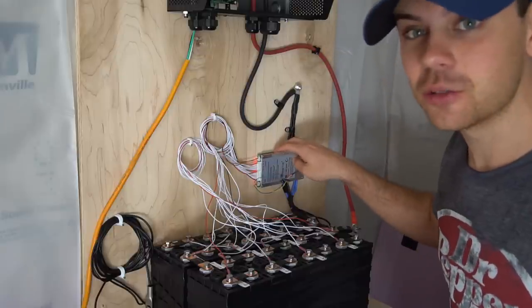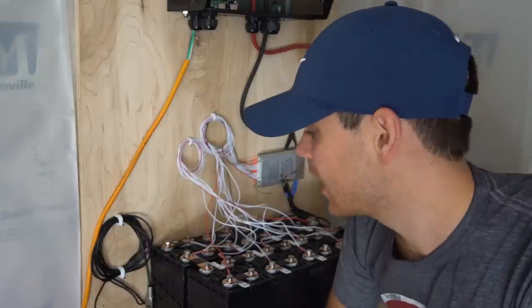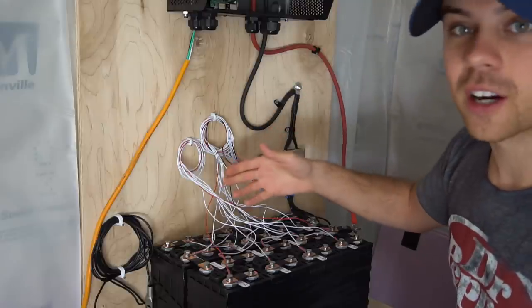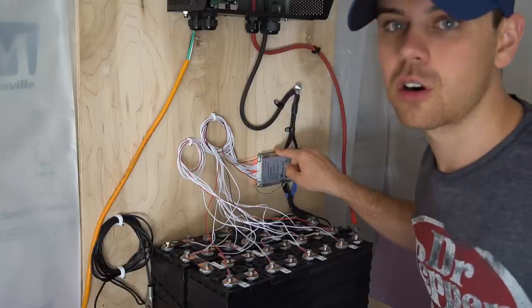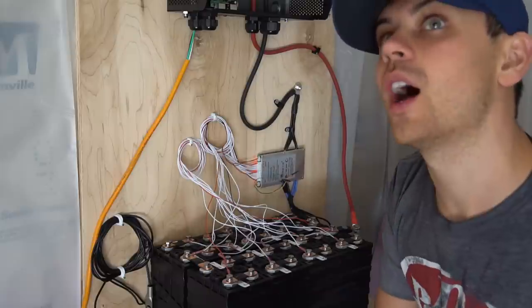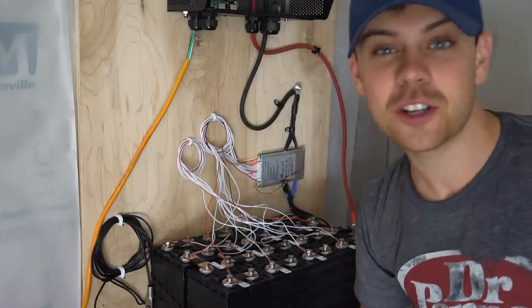This was $72, and if you buy cells used and then buy an MPP all-in-one unit you're talking about a very powerful system for very cheap. People are going to use these in DIY systems and save a lot of money — we need that option on the market. I'm going to test this over the next couple of years, leaving it in place. It's programmed with low temperature disconnect so it'll be interesting to see how it performs in freezing winters. I'll also lower the charge voltage to about 70% state of charge to prolong cycle life. So far this thing makes me happy — it was a pain to set up but I do like it.